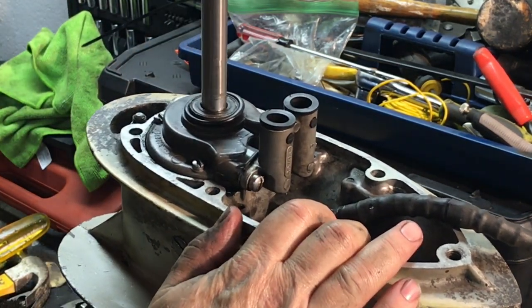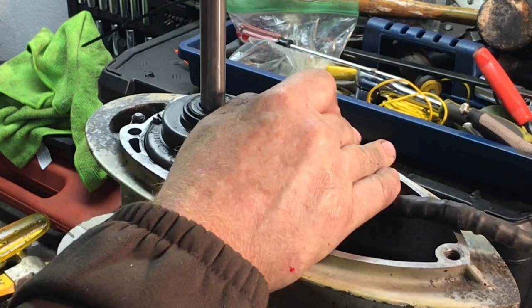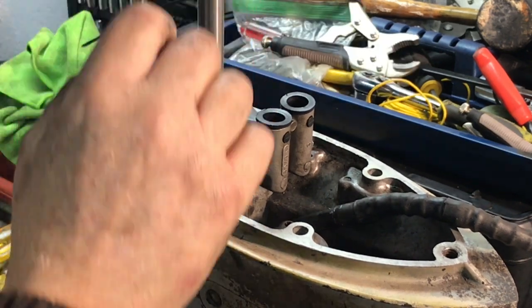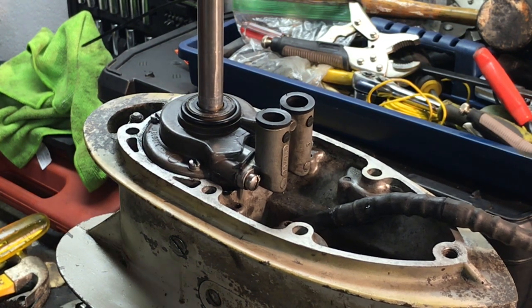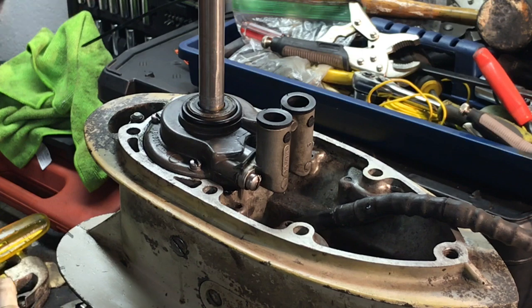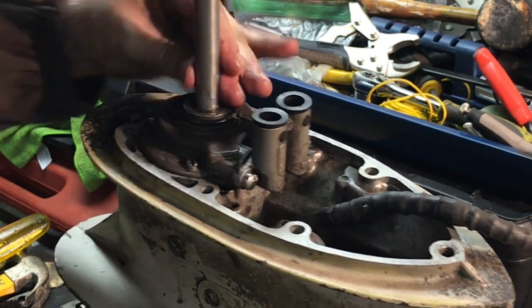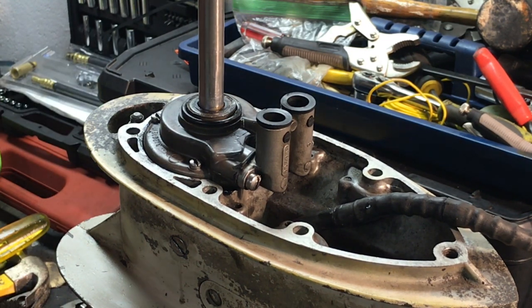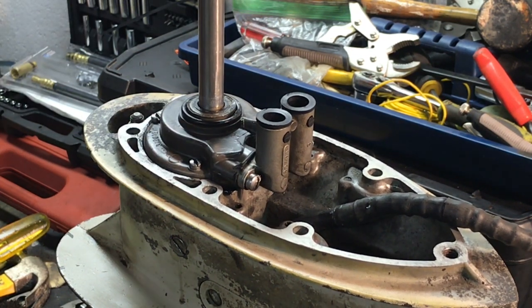So now the water pump is in, it spins freely, I don't feel any problems with the bearings — they feel pretty good and smooth. Let's put a little more grease on this — just a little more. I wiped off quite a bit of it, but this just keeps it from corroding. The water gets on it and it's stainless — but stainless can still corrode, it just takes longer depending on the quality of the stainless. I know because I work in metal finishing. Stainless is the best metal to use for this kind of application, but it takes the longest to start showing any signs, especially in salt water.